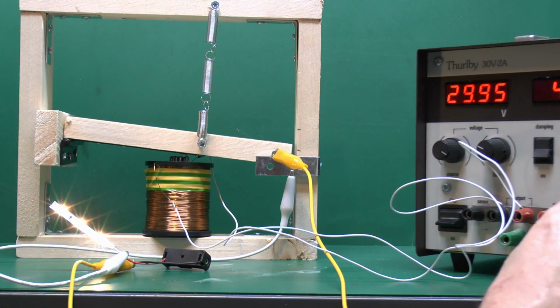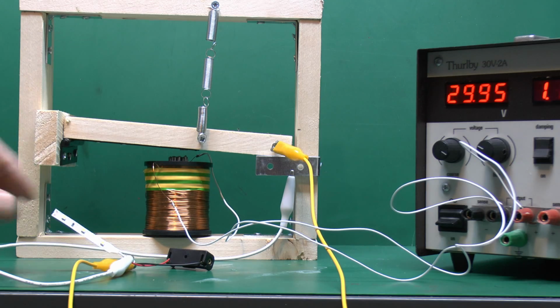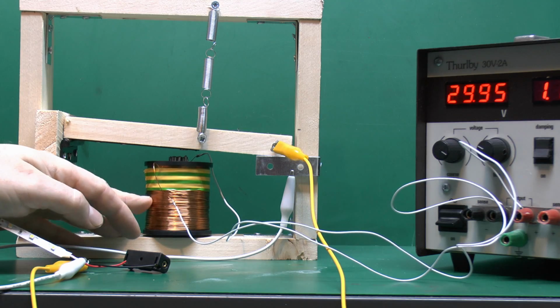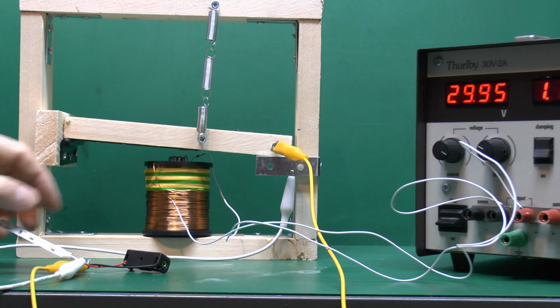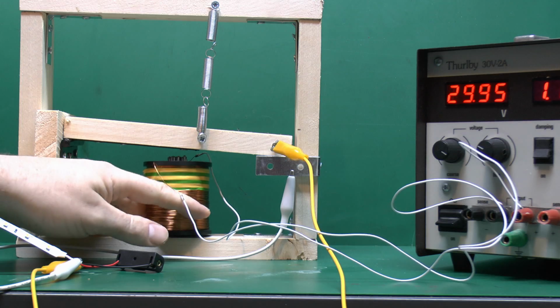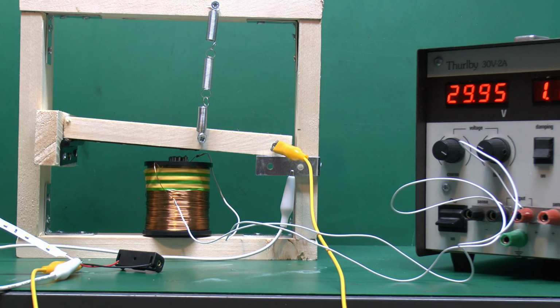And the important thing to note here is that the circuit for the LEDs, as in from this little 12-volt battery, is completely separate from the thing that's powering the big coil of wire here. In this case it's a 12-volt battery, and we're powering the coil from a 30-volt supply. But these could be pretty much any voltages. This could be, say, a 240-volt coil, and we were switching, say, something at 6 volts. Or conversely, we could have, say, a 12-volt coil, and we could be switching, say, 400 volts on the contacts. And, of course, pretty much any combination, because there's no electrical connection between the contacts and the coil.